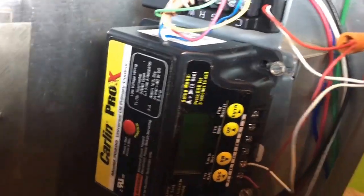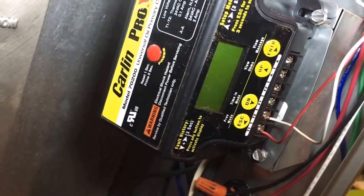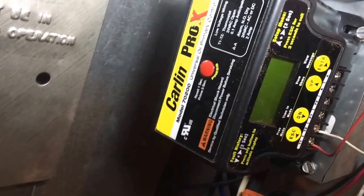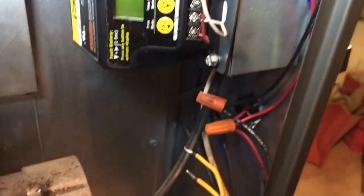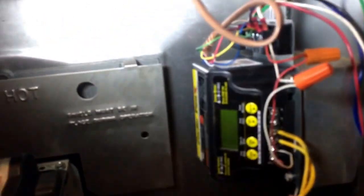I used RC, RG, and Y — that's the only wiring we use over here. Hopefully everything is okay, as long as nobody changed anything at the thermostat. I've got to connect the T&T and we're going to fire it up. Okay guys, I'm going to switch it over here and see what happens.